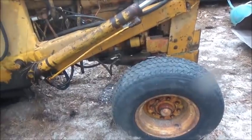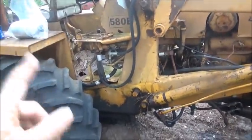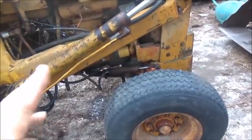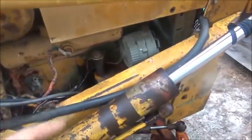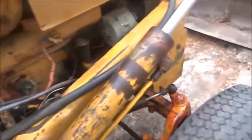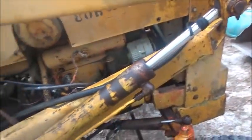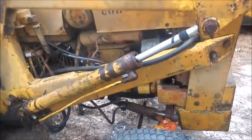The mechanic who worked on this is a friend of mine, but it's been many years. He thinks he put a used orbital valve on it because the original was leaking really bad, and he thinks they repacked the steering cylinders, but one of them may be hooked up backwards - may or may not. The pump doesn't seem to be pumping at all, I can tell you that right now. So I bought a new gear-driven pump - $166 - and they've sold a couple hundred of them between a couple of sites, so it must be a pretty common issue.